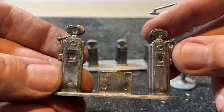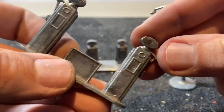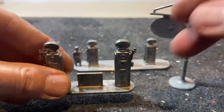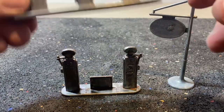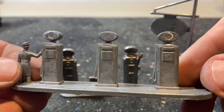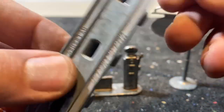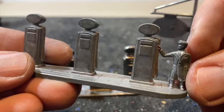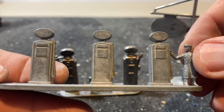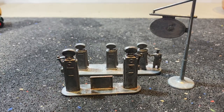On the Wardi pumps, these actually stripped really, really easily — just one dunk got most of the original paint off. These castings are damaged; they would have had little hoses on the side, but I don't have the pieces to reattach those, so we're going to paint them as is. The SO pumps really cleaned up pretty nice — it took about three dips through my stripper to get most of that original enamel paint off, but it turned out really nice. I've done a little cleanup on the casting lines, but I want to restore this as close to original as possible. So we are ready to head into paint.